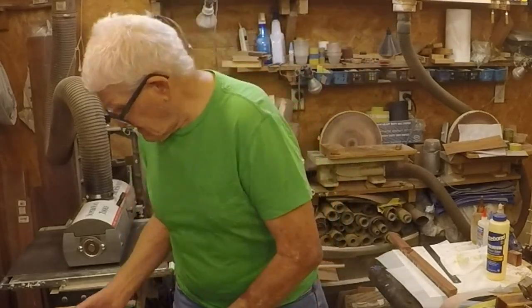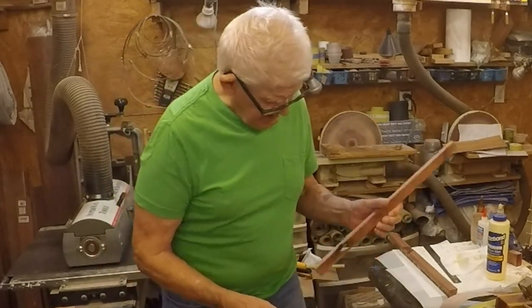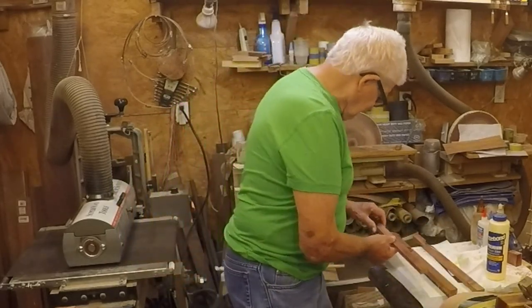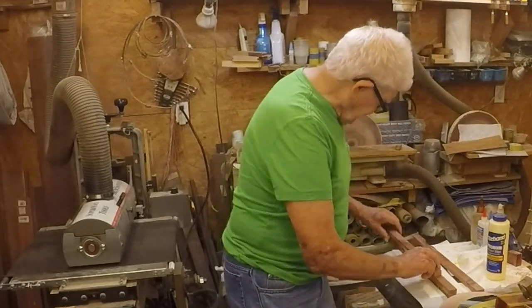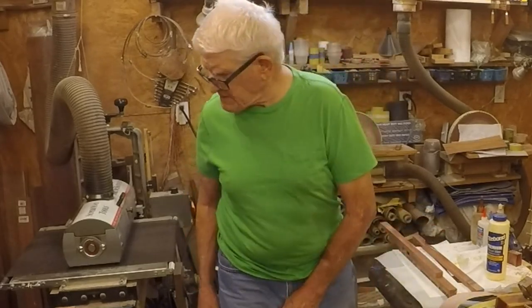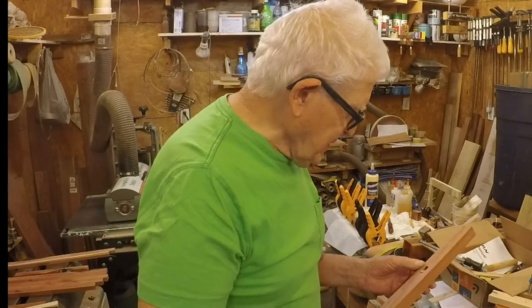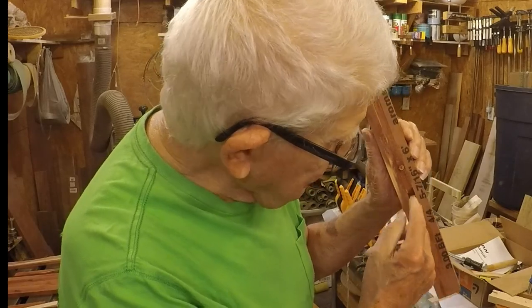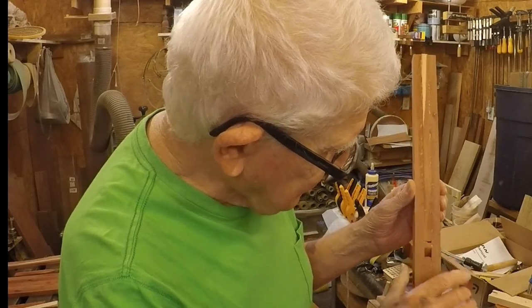I've got this glued up now, and you can see what I did. I've got the 40-degree angle here, and then I've got a straight — this will be the sound hole. The top's a little bit tighter than 7/32, which is good. When I smooth the top off running through a planer or a drum sander, it'll open up a little bit, so it'll be okay. And this is the supply air hole — they want the air to run smooth, then it goes over the top. I got it at the same angle; it doesn't have to be — it can be square. Now I've got to do another side on it, and this will complete the top piece.